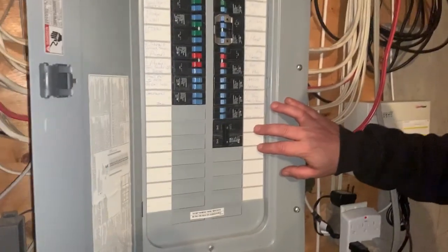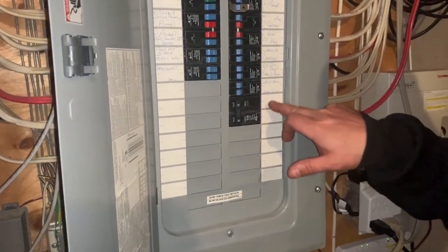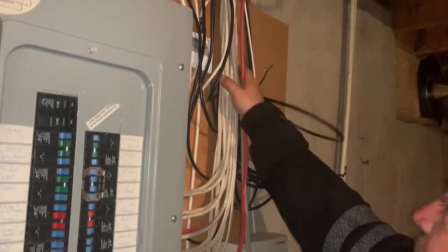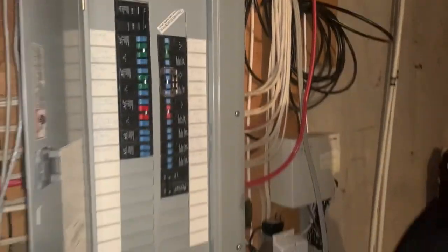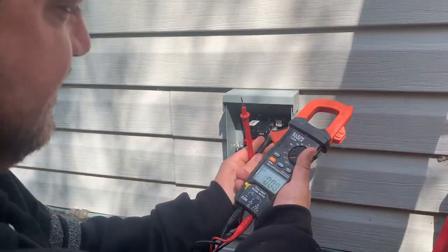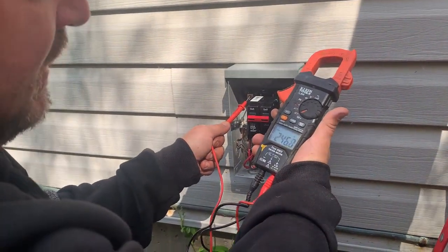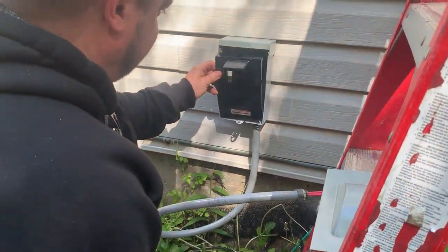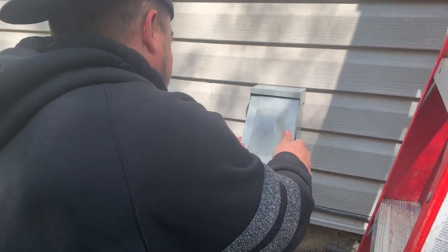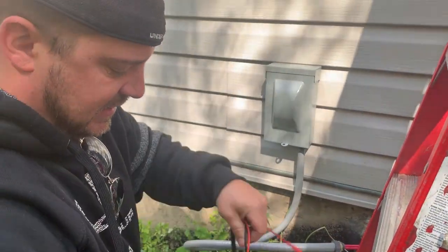Come in a little closer — you can see the breaker here. We'll mark it 'mini-split heat pump, living room' and put a couple of straps on this wire. Now we're going to do a quick meter check on this just to show the voltage. Going across our two lugs — we have 246.5 volts. Basically now we can stick our covers back on. There you have it — one wired mini-split heat pump.